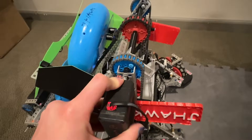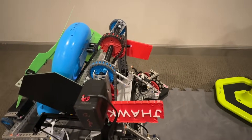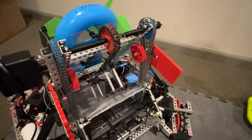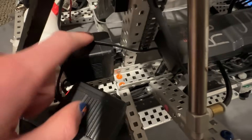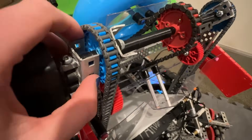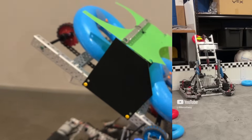The hooks — basic stuff: 200 RPM, 18-tooth sprocket, and it uses lifted intake tech, similar to what we had on the MOA robot, except this one is motorized instead of pneumatic. Down there you can see we have a 100 RPM motor — that goes over a shaft running all the way across the bottom. That shaft has chain going up over there using IQ sprockets with their holes drilled out so they can idle around a high-strength shaft. So they don't spin with the shaft but have the same center of rotation, meaning the hook system doesn't move and we can just raise that up to do wall stakes.